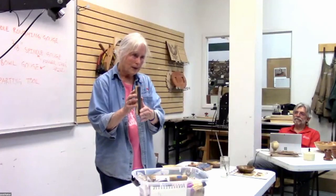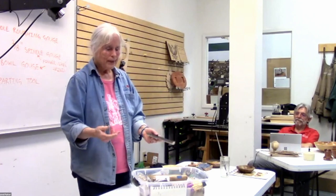Robert, how fine do you have to sand the wood for this? Can you sand it down to 600 grit? I didn't. Here's a piece of curly maple that I just put black on today and I hardly sanded it. So you can just use the milk paint. The wood doesn't have to be sanded. You can use this paint on really finely sanded wood, or it can cover up a lot of mistakes that you make. You can put a lot of layers on, you can mix it thick. So there are just so many variables.